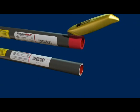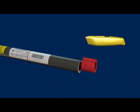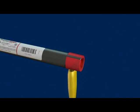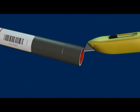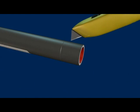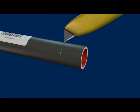Make a slit up one side of the thread protector with a knife and remove it from the conduit. Push the thread protector over the cut end of the conduit to be threaded and place a mark on the PVC coating at the end of the protector. With a knife, cut around the circumference of the conduit at the mark, through the PVC coating, to the metal. This cut will indicate the starting point for the longitudinal cuts and will give an even ending to the PVC coating removed during threading. The longitudinal cuts will allow the PVC coating to be removed in small pieces instead of long strips that can foul the die head, causing the conduit to collapse.